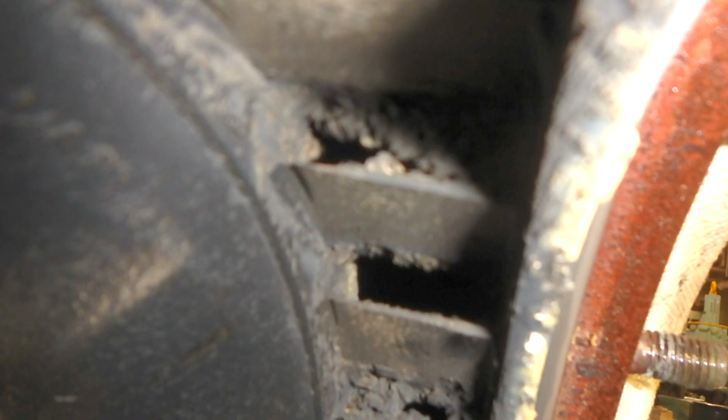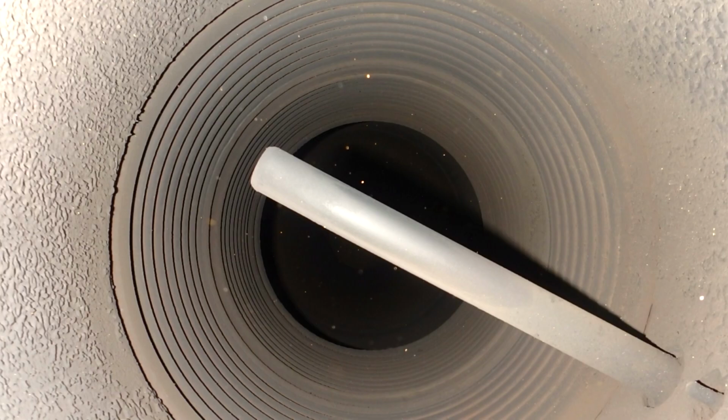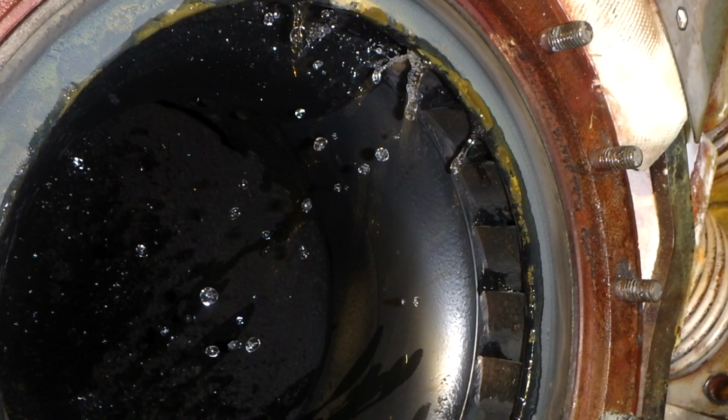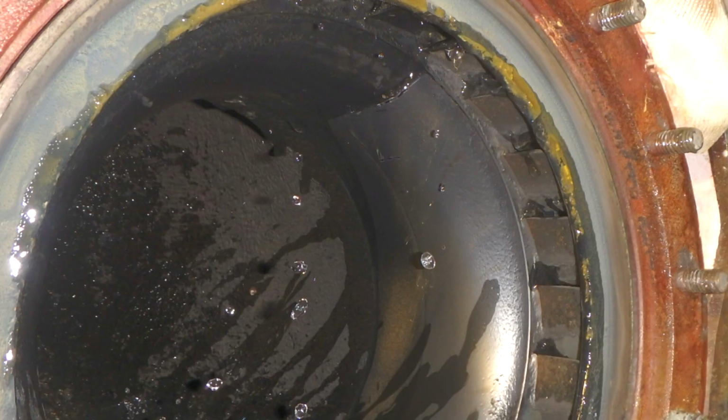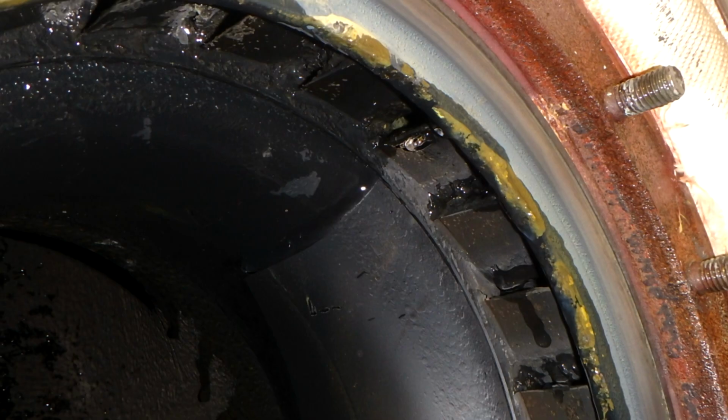Mostly the cracks happen in the outside area of the blade, and through the washing process there is also a corrosion effect, because with the sulfur and water mixture we have this acid, a strong acid. And here also, when we place everything back, we check the nozzle rings, how the water injects inside to the blades, how the water is passing and the quantity of water which is entered.